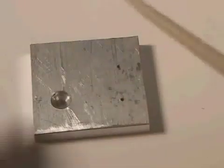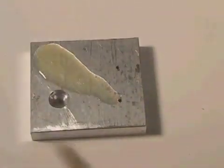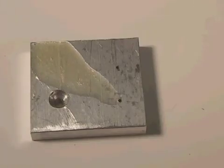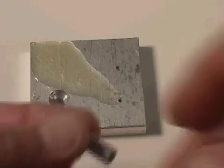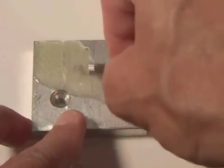When we machine, we're probably going to be using a coolant. The coolant provides cooling during the cutting process and provides lubrication. It also prevents the chips from sticking to the end mill as the cutting process takes place. So we will definitely be using a coolant.